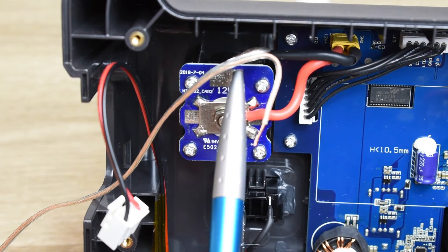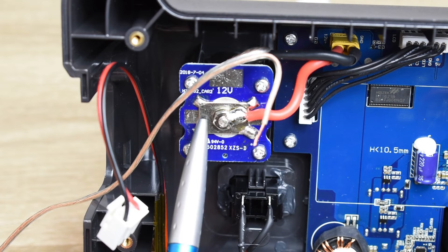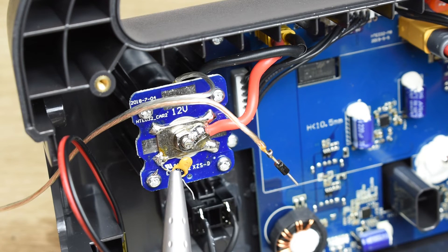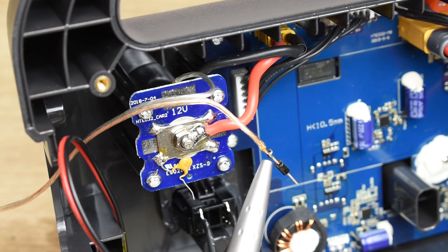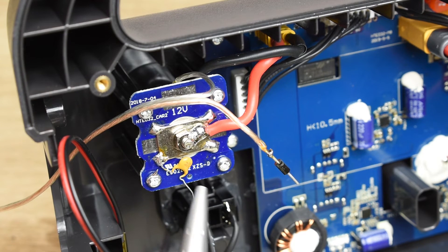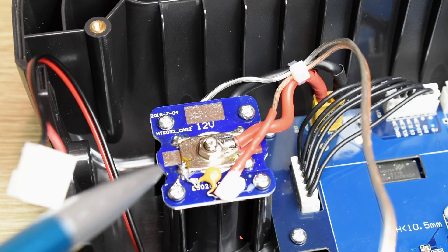The negative is attached to the rear side of this board and all the screws are back in. The next thing I'm going to do is solder on the PPTC resettable fuse. You may be using a 500 milliamp or 1 amp axial fuse, but I'll be using the PPTC. After the PPTC, I'll connect to the anode of the diode, and then the cathode — which is marked by the white line — will be connected to the output point. The PPTC is now soldered in position. The line on the diode marks the cathode, which goes to the COB LED panel; the unmarked side is the anode, soldered to the other leg of the PPTC. I slid heat shrink over before soldering the diode to the PPTC — here it is completed.